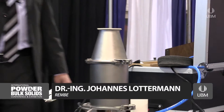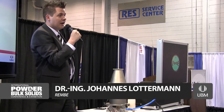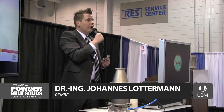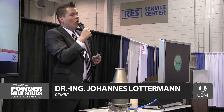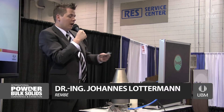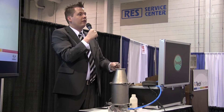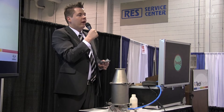The typical concept to protect installations where you have to consider explosions is to use explosion venting devices. Explosion venting devices are simply spoken predetermined bursting points of your installation — the weakest part of the entire installation — in order to allow pressure relief to a designated area. I will equip my explosion relief device on this test vessel and then carry out the explosion.